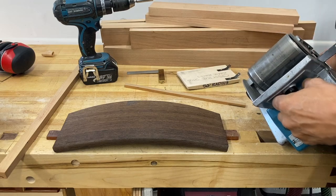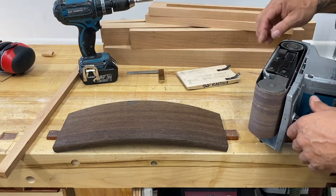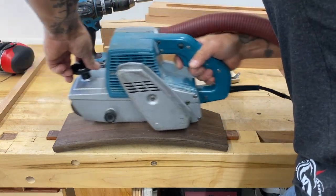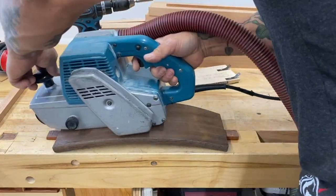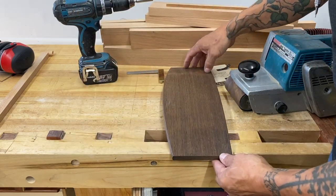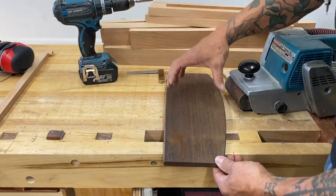Remove that, put the screws back. How about an outside curve? Well, of course it would be just as easy — you need to watch this wheel in the front and in the back, but it's going to work the same way. For something like this, I would clamp it at one end of my bench and let it overhang so the bench isn't interfering, and then bring the belt sander over the edge, flip it around, and do the same thing until it's nice and smooth.